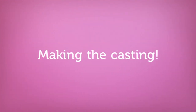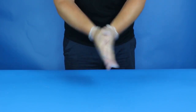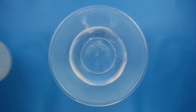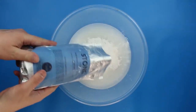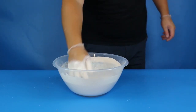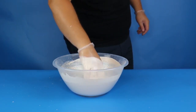Making the casting. Now that we have our mould prepared, cleaned and dried, it's time to make the liquid stone to pour into the mould. First, let's pop on those protective gloves because the liquid stone heats up as it dries. We're going to measure the water needed for mixing the stone powder. If you have a regular kit, measure out 750ml of water; if you have a large kit, you'll need 1,175ml. Pour your water into your plastic mixing bowl and get your timer out — you have 5 minutes to perform the next couple of actions. Pour all of the stone powder into the water, then let it soak for roughly 60 seconds. After that, stir the powder into the water using your gloved hands until all lumps are gone — about a couple of minutes. The liquid stone should turn into a smooth paste with a thin, paint-like consistency.